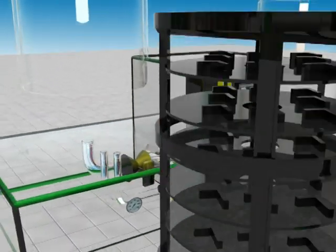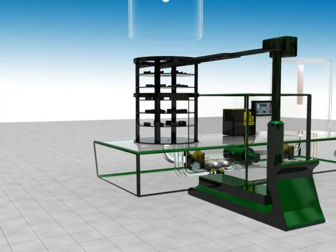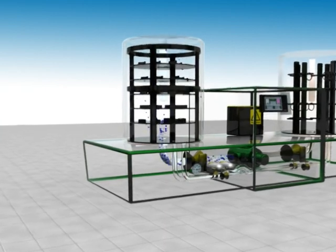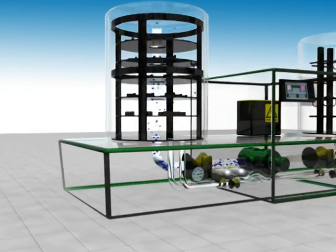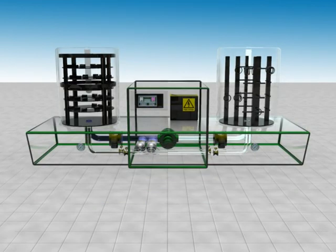Electrically insulated from the housing, the workpieces are placed on a workload fixing. The vacuum chamber is closed and evacuated to a pressure of about several pascal. The outside auxiliary heating of the vacuum chamber is switched on in order to quickly reach the necessary operating temperature.